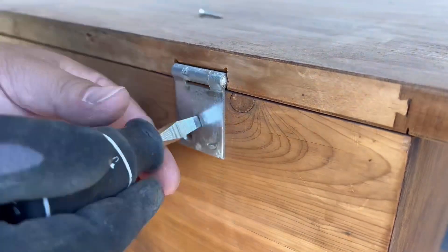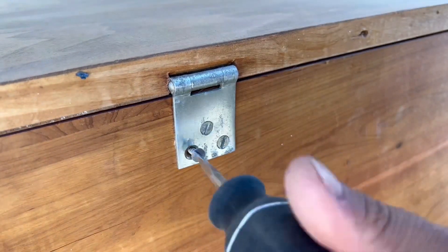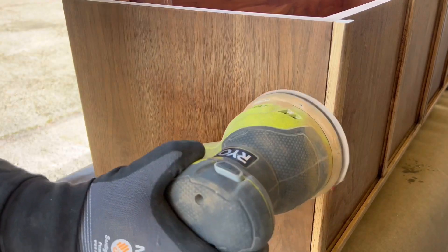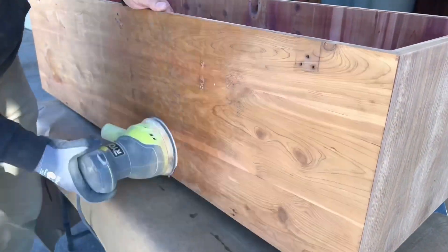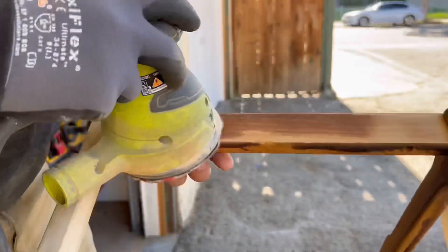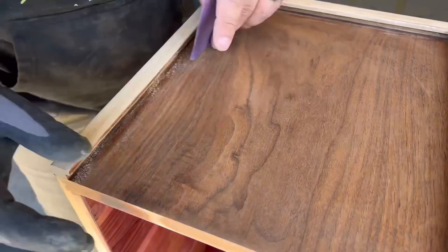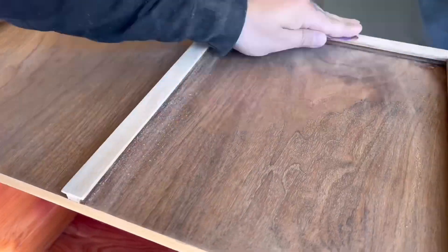I'm removing the top to make it a lot easier to move around and also so that when I stain the top and sides I don't get any stain on the inside boards. I'm also sanding down the back — I don't plan on sealing it since it's cedar, but I want to clean up the water spots and stains to make it look really nice. After finishing with the electric sander I hand-sand all the tight corners and tight spaces the sander couldn't reach, starting with 150 and finishing with 220 grit.